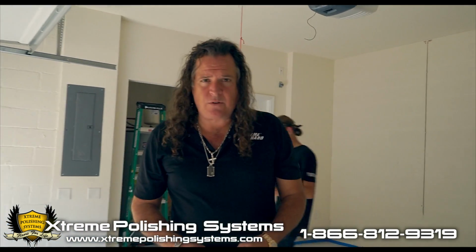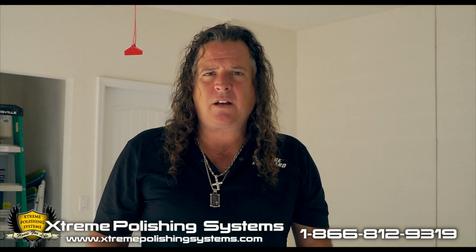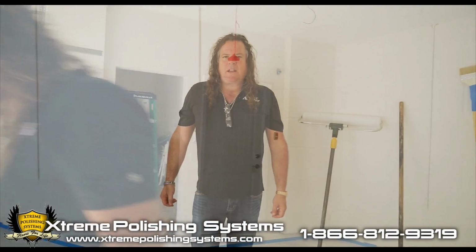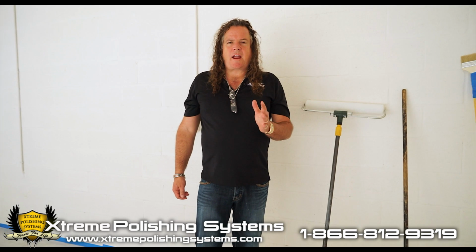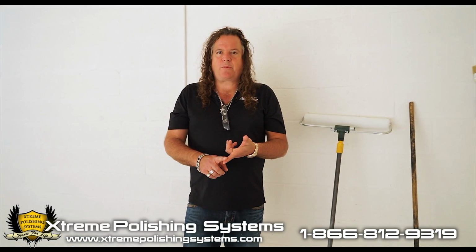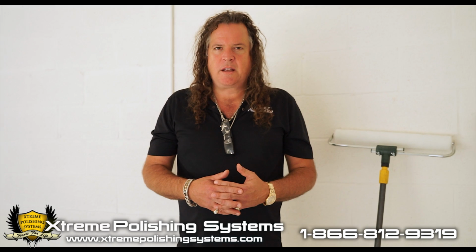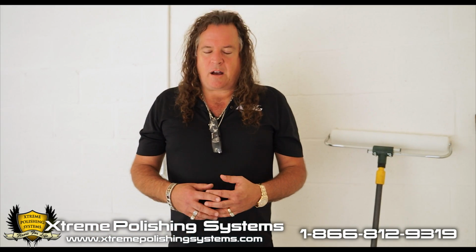And now we are going to put down our red primer, which is going to be the first step of the epoxy process after the surface prep. Okay, the main thing I want to reiterate to everybody is preparation is 90% of an epoxy job, okay? So your floor prep is super, super important. Don't think for a second that you can cheat the system on floor prepping, otherwise you're going to wind up spending a lot more money on epoxy because you didn't fill all the voids. You didn't use the crack filler, do you know what I'm saying?